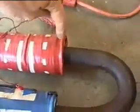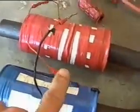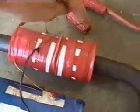The coils on the magnet have got the start winding on the same end, and the start winding of one coil is connected to the end of the other coil. And they're left connected. So this is the end of this coil connects to the start of this one.